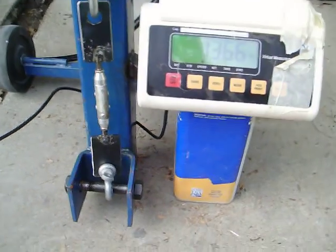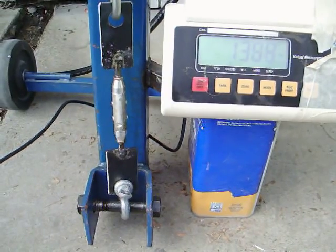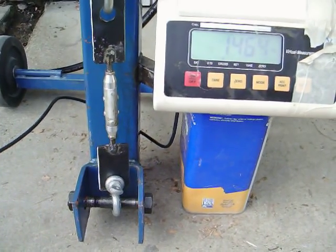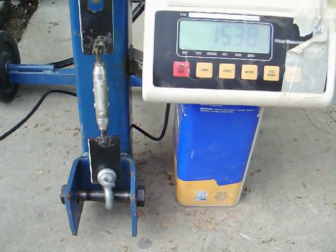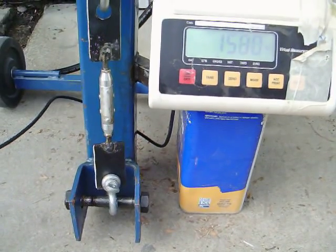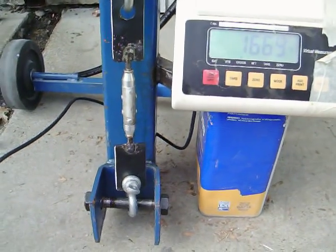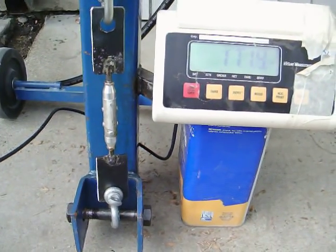1,300. We're going to get a reposition here. 1,360. 1,400. Almost 1,500. There's 1,500 pounds of tensile force on our little sample. It's feeling a bit squishy in the handle — we might be breaking this little sucker pretty soon. There's 1,600 pounds of tensile force. 1,650.